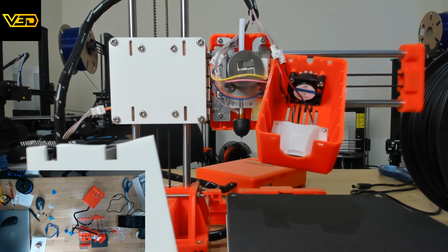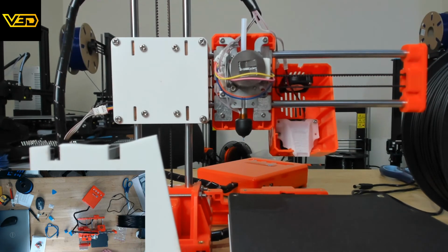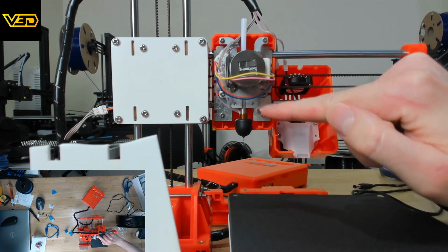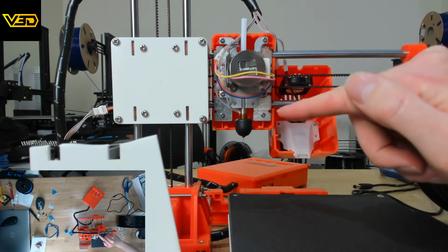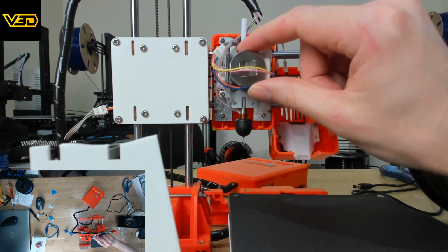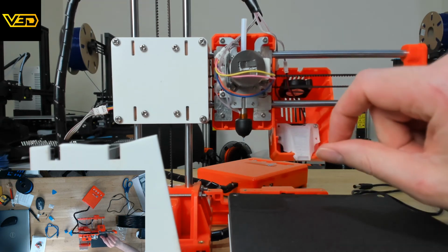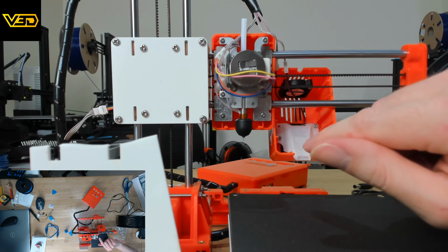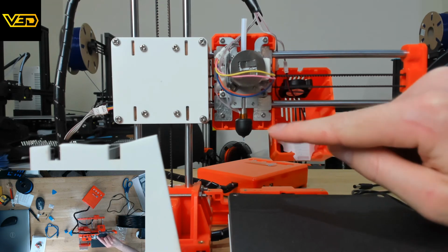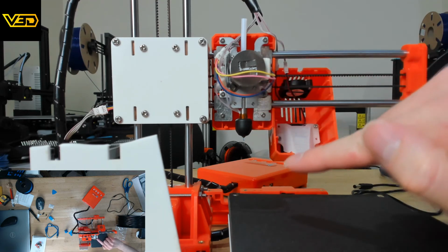I don't think there's much we can learn by taking it apart any further than this, to be honest. So obviously you've got your stepper motor right at the top here, the heating end down here. Normally you'd see a cold end heatsink fan in here, but it looks like they're just using all the other metallic parts that it's joined to and a cooling fan in the top to rely on cooling it. That's presumably one of their limitations with their 180 degrees C max temp. I'm guessing that if it goes over 180, then it starts to have thermal issues with other parts.